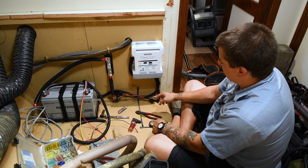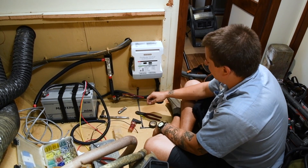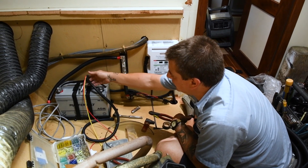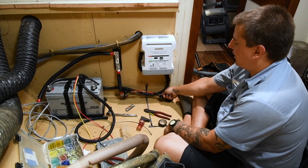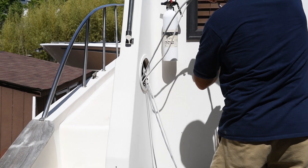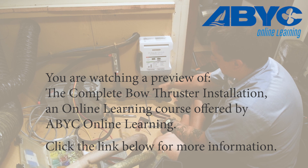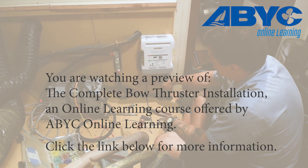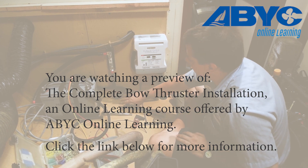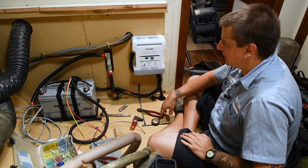Now that we've run the wires up here — one of them was the AC wire from the AC panel up front — we have it wired into the charger, with the DC output coming over and ready to hook up to the battery. The main on-off power switch at the helm is this gray wire, which is going to control our solenoid and turn the power on and off. We also have another set of wires going down to power the computer to the thruster, which will come on when the solenoid is switched on to give the whole system — the brain, everything — power and keep it charged.